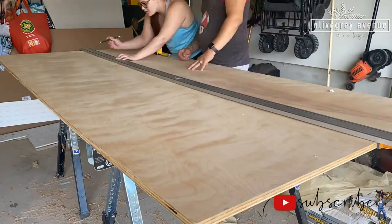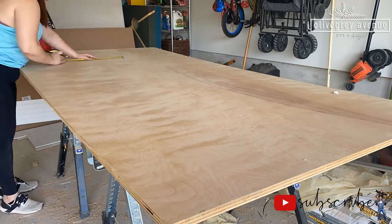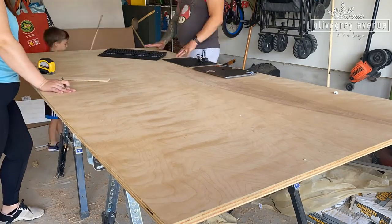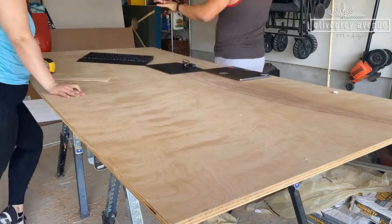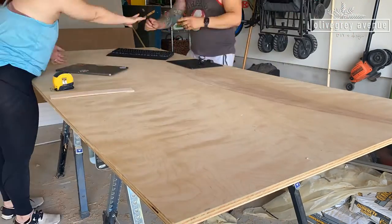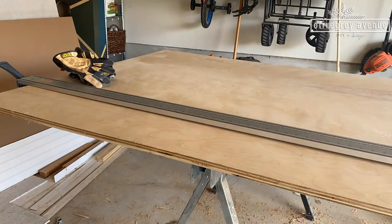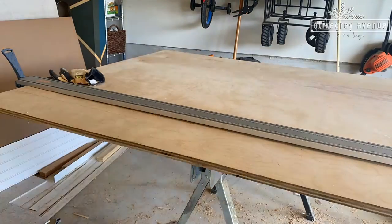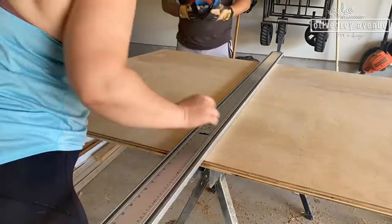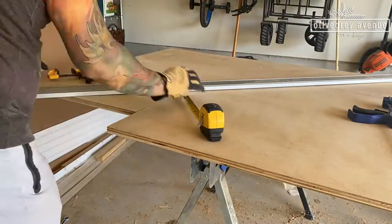The whole desk is made out of one sheet of birch plywood — a four by eight. It's going to be a corner desk, so we measured the depth and length of each side. I wanted Steve to be able to sit in the corner, so once we drew the lines for each side, it came to a point. I measured out 12 inches from there and drew a straight line to give that nice corner desk feel. We also got a huge 100-inch clamp to help us with the straight lines.